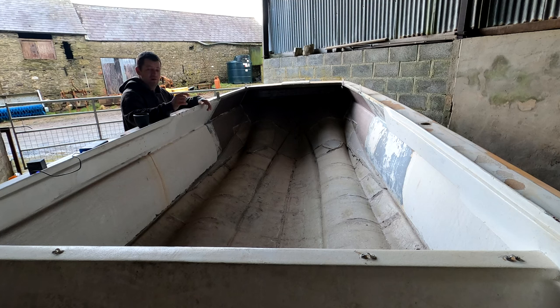It's going to have three layers of Biax combination matting on the outside and probably two, three, maybe even four layers on the inside. In the centre I'm fibreglassing that as well — maybe three layers there. Then I'll have the stringers in and do a layer or two over the stringers. This boat's going to be flipping strong. Right, I'm going to get into sanding. I don't want to be waffling — I'm wasting time.